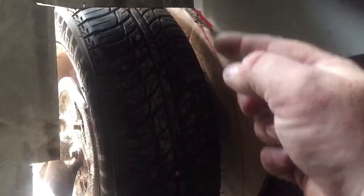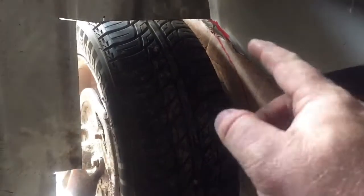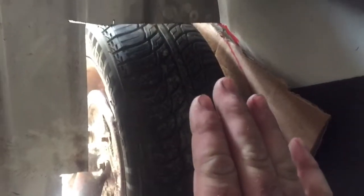And yeah, that might be our outer part of the new inner wheel arch. You'll see what I'm doing. I'm kind of making it in 3 bits. I am going to make a panel on the inside here to weld around the actual wheel arch itself. Then the flat piece of steel sort of folded up over that, and then an inner part as well, which is going to miss all the swinging arm and everything. So cool. Let's do this bit.